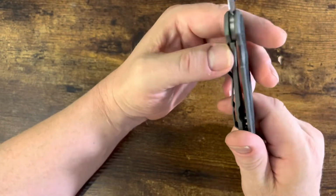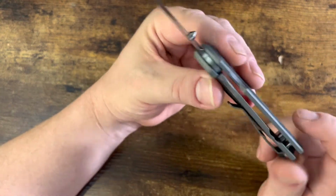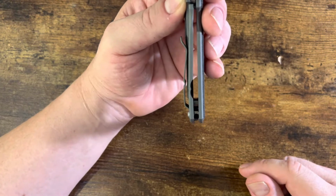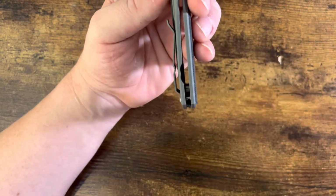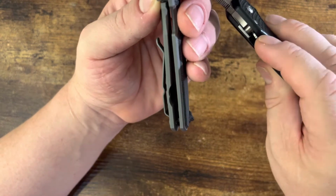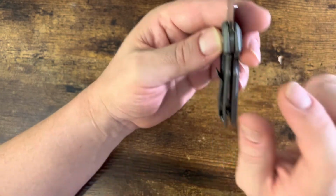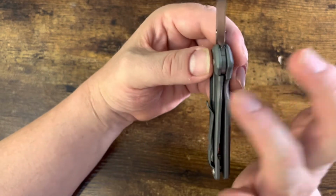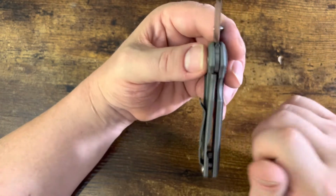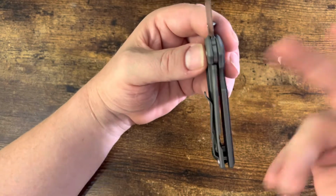Nice lock-up interface. But hardened titanium, carbidized or carburized or whatever you want to call it, isn't much different in Rockwell hardness to something like the 420 series that you usually see in liner locks. Anything that is basically like the steel, even something like a compression lock, but it's not a standard liner lock like that. That right there is just basically like 420 steel. It's not super hard. In fact, it's not much harder than the titanium, but as far as wear resistance, I would actually believe in the titanium carbides and all the stuff that goes into there, and some of the stuff that forms on the surface when you carbonize it, really has a high wear resistance coefficient.